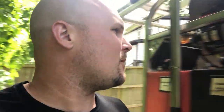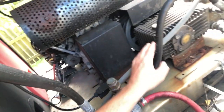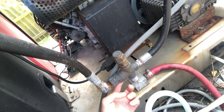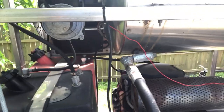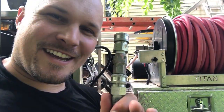This piece right here is called an unloader. The unloader comes from the pump — it's pushing water out of the pump. The unloader is downstream from the pump, and this is what shuts off the high pressure when you let go of the handle. The high-pressure hose then goes through my burner — which many of you don't need or have — and comes out here. This is where you're going to connect your downstream injector.